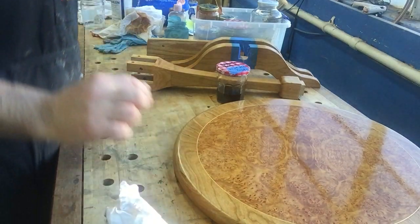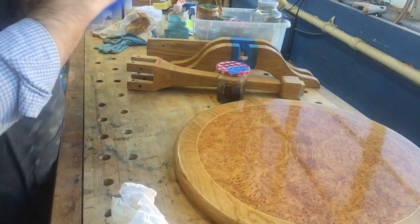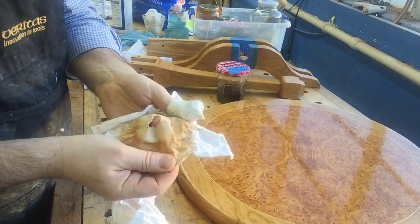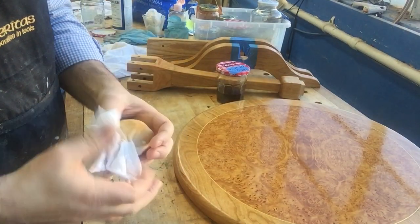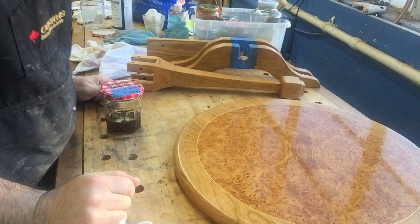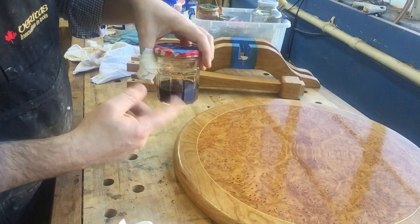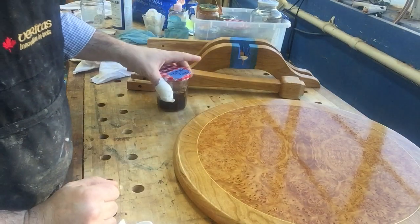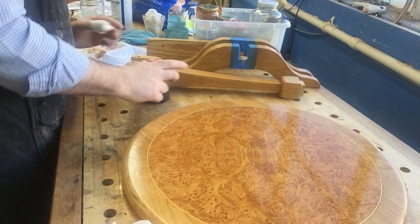Here's my pad. It's made of this sort of felt, and then a piece of cotton. What happens is the cotton wears through, and once it does you just get rid of it and put a new square on. As I go through the padding process I add more alcohol, so my solution becomes more diluted. Although it started as a two-pound cut, it's going to be considerably less than that as it goes on.